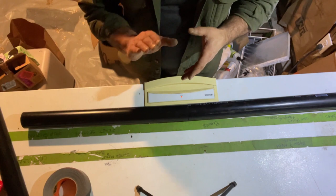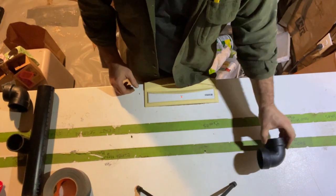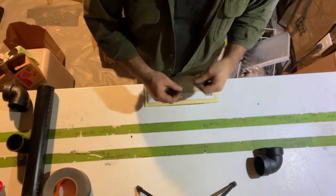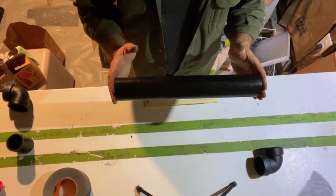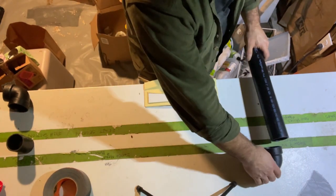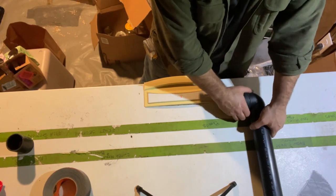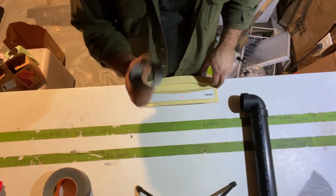Now let's take a look at the exhaust side — the side that the warm air from the cold room can go up and out. That one is far more simple. The exhaust side is going to start just like our intake side did with a 90 facing the ground outside on the outside of the wall. Again, we're going to be using our piece of screen so that no critters can get in there, and that will face down so no rain or snow will get in. On this one, instead of having a smaller piece just inside the wall to go down through the shelves, I have a much longer piece cut to the length to bring me all the way to that next floor joist. When we get to the other joist — that other two-by-eight — we'll put our next elbow also facing down into the room, left open with the exception of a small little piece of pipe.